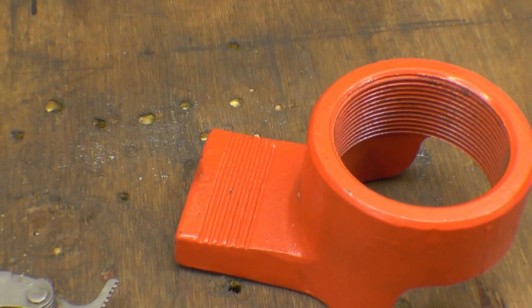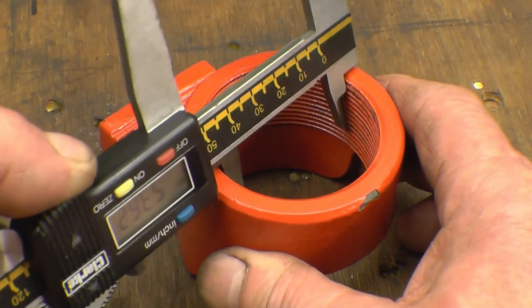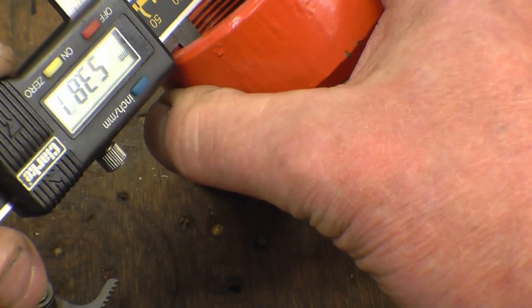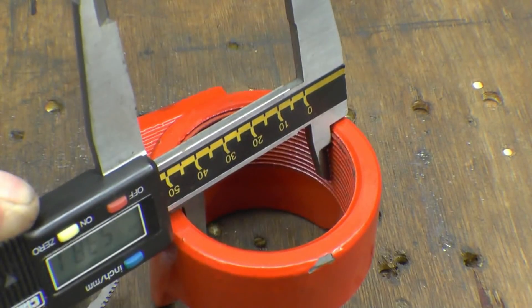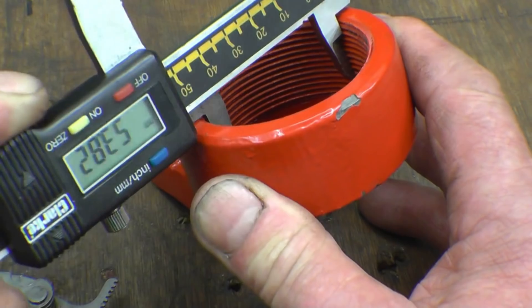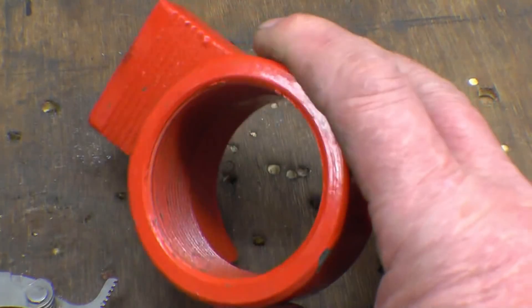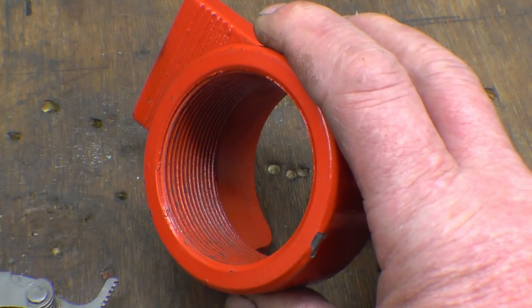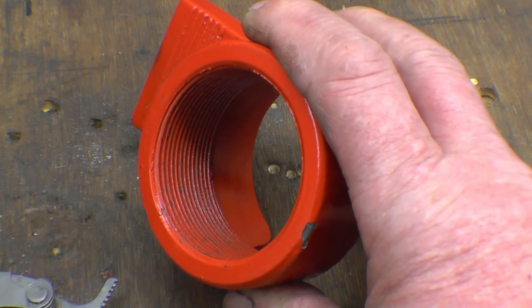Next is the diameter. I'll tell you, the one I normally use has just died. I'll have to use this one. And that's giving me a reading of 53.8. Now the 2mm pitch thread is 1mm deep, so if I add 2mm onto that - 53 plus 2 - it's 56. That's going to be a 56mm thread. So I'm going to find a bit of bar and cut a 56 by 2mm thread on it, just to make a test piece so I can machine these plates out to size.